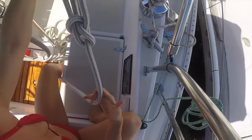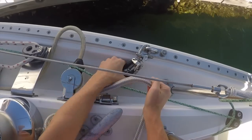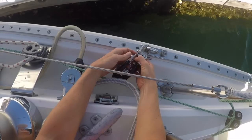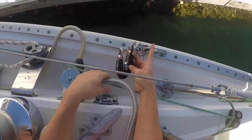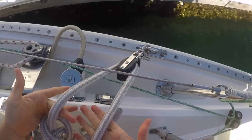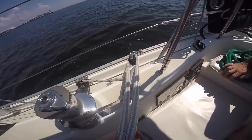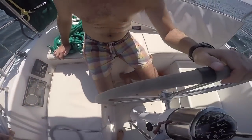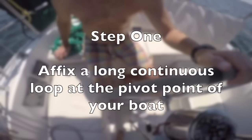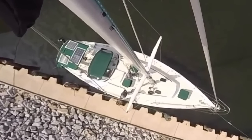Now we have our whole long continuous loop. You may find on your boat you have a cleat or chock or some other fixed point that gives a fair lead to the dock right at your pivot point. We don't, so we attach a snatch block and use that. Our one long continuous loop is lined up right with the rudder. On our Niagara, the pivot point is in line with the rudder.